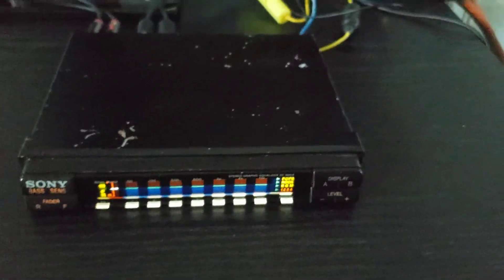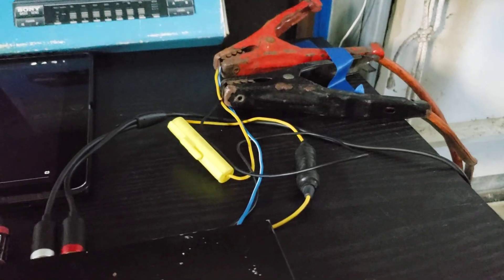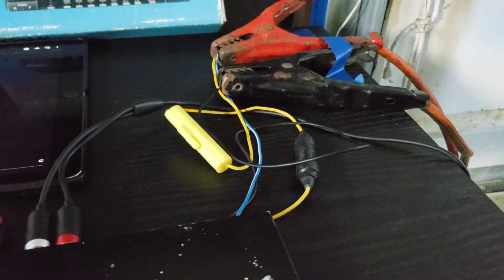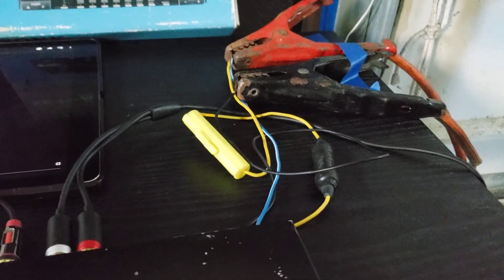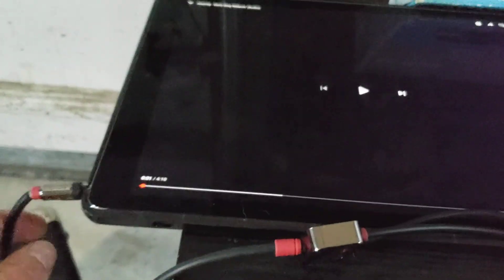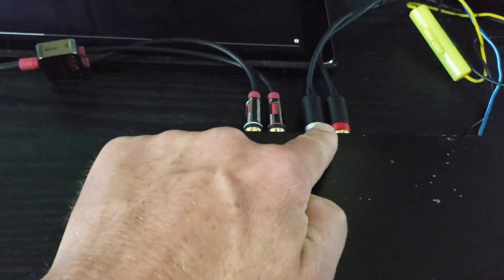What I did is I rigged it up to power from a tractor battery, so that's what the jumper cables are for. The blue and yellow wires are — the blue is the amp trigger, the yellow is the power, and black is just the negative, going to the black battery terminal. And so that's the setup there, and then I have an iPad with the outlet cord going into the inputs on the back, and then I have outputs to the front speaker going around into this little PA speaker. So I'm going to queue up Don't Stop Believin' right now on YouTube, and we can take a look at this.